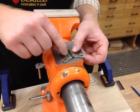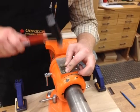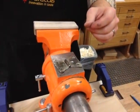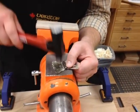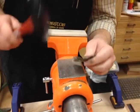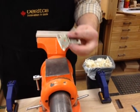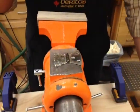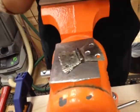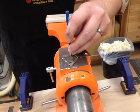This is kind of the general start to it. You work around the border trying to get that shape, and then everything in the middle is pretty much decorative once you get done. So I want to keep this as my structure and then my outside edges as decoration. Let's move to the middle and start just peening it for decoration. The hard part is always the transition from the random hammering marks to where you've punched it, so I'm just feathering this out.